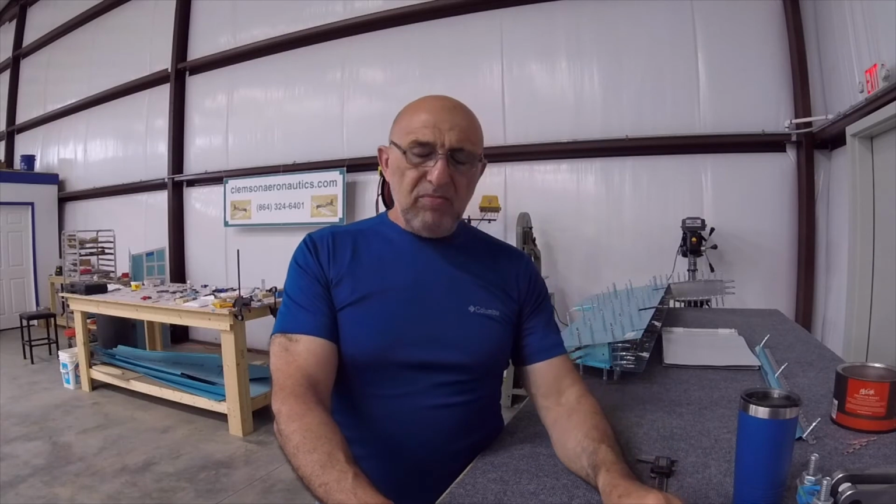There is a couple of times where it was only like 4 or 5 holes that was dimpled, and I went ahead and dimpled them, then scuffed it. And it really did the number on the little Scotch-Brite pad that I had. But this is the best method that I thought worked out great for me, is to get the hole prepped, scuff it, clean it up, dimple it, then clean it up again, then prime it, then leave it to dry, and I'm ready to rivet.